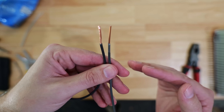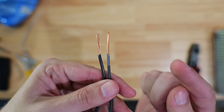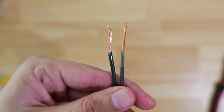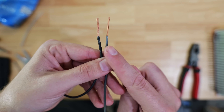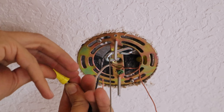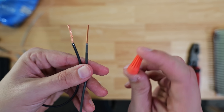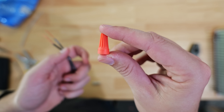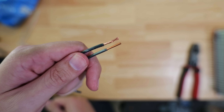This next one is an incredibly common connection that has to be made: connecting solid core to stranded wire. This is probably the hardest one to get right and one of the most common ones to fail. Most of the time you've got your solid core wire running throughout your house, then you might be installing a light fixture or ceiling fan that comes with stranded wire. Almost every time they include some sort of cheap wire nut, which oftentimes is not designed to help promote twisting the wires together underneath.